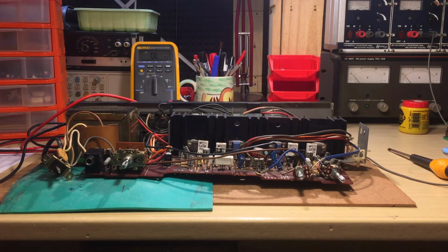Jeez. So the first thing I did, and the first thing you should do if you have a crackly noise or a known bad amplifier like that, is measure the output in DC and AC. Especially DC. If there is any DC on the output, so continuous current, it's something that went very bad. On this one, the right channel is perfectly fine. There is an offset of just below the 100 millivolts mark, I think it was just 50 millivolts, which is just fine. But on the left channel, there was an awesome DC offset of plus 10 volts.